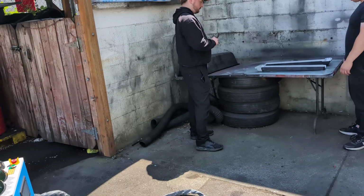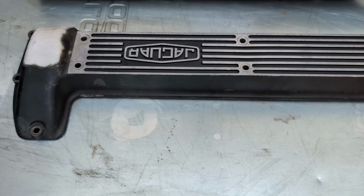Now, if we turn it over here, I got a shot of you guys doing the other side, and this was powder coat. And it was just killing that powder coat, which is pretty unreal because sandblast doesn't usually touch powder coat very well at all, right? No. Powder coat, because it's a polymer-based coating, it likes to reflect the pieces of garnet, and the reason why is because it's a plastic makeup, right? So with this, because it's light, it stands no chance. It just vaporizes it much faster and more efficient.